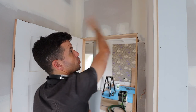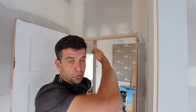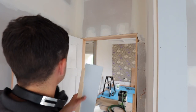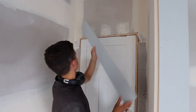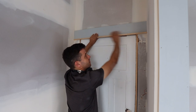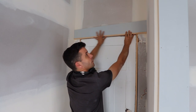Here's how we're doing the architraves on the inside. When I put the doorway in I made sure it was dead centre between this wall and this wall. We made it so the architraves go from wall to wall as well — that way you don't have to plaster the internal corner, you just paint the architrave right up to the corner. It's just made up of two pieces: the top piece and then the bottom piece goes under it. It's easier to nail the bottom piece to the top piece and then put it all in as one unit.